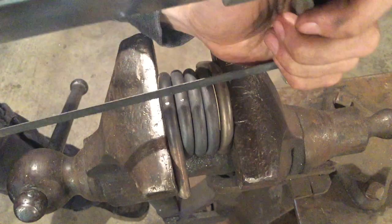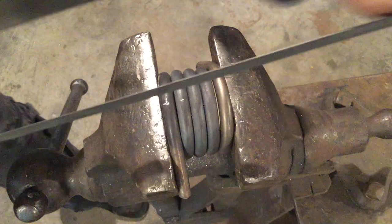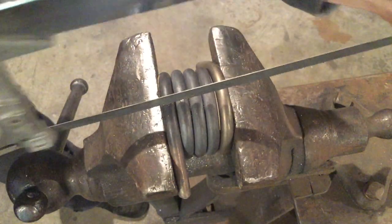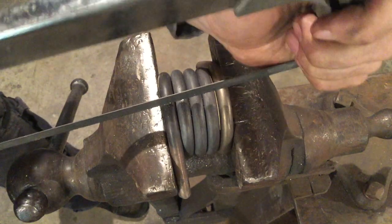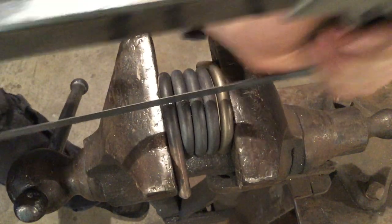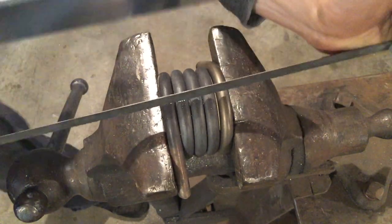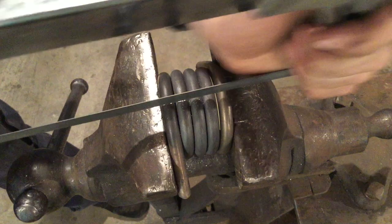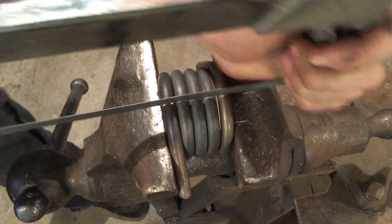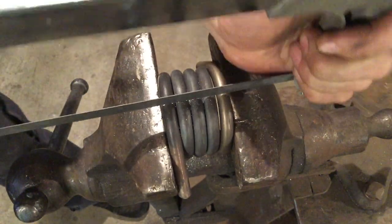The hard part is starting your cut so it seats. Generally I'll start with one ring, and once that seats, it's a good idea to make sure the blade rocks over and tags down on the next ring. You're looking for each preceding cut to seat in the remaining ring.